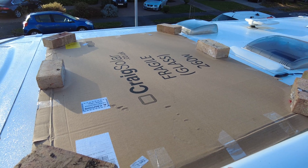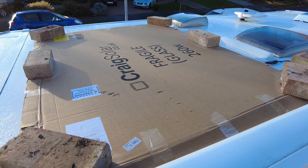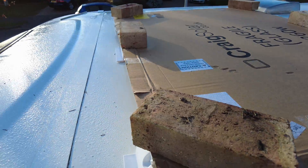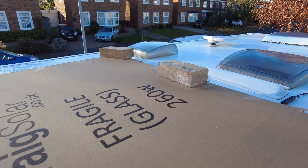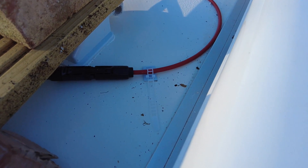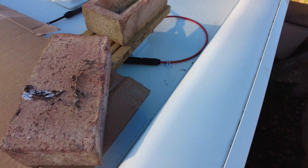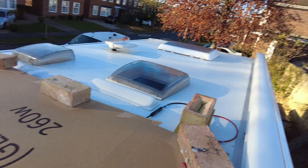It's the next day. Unfortunately the battery died on the camera yesterday, so some things we did aren't on camera. We turned the solar panel over and pushed it down, then put some cardboard over the top to protect it and put some bricks around it just to hold it down overnight while it sticks down. On all of the cables we've used adhesive cable ties to stop them flapping around, and we also stuck down the gland. Today, unlike yesterday, the sun is shining, so I'm going to remove this cover and see whether or not we've got some solar coming in.